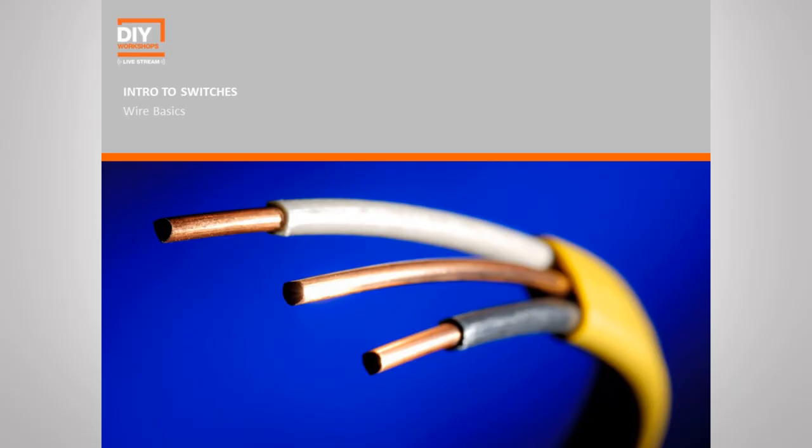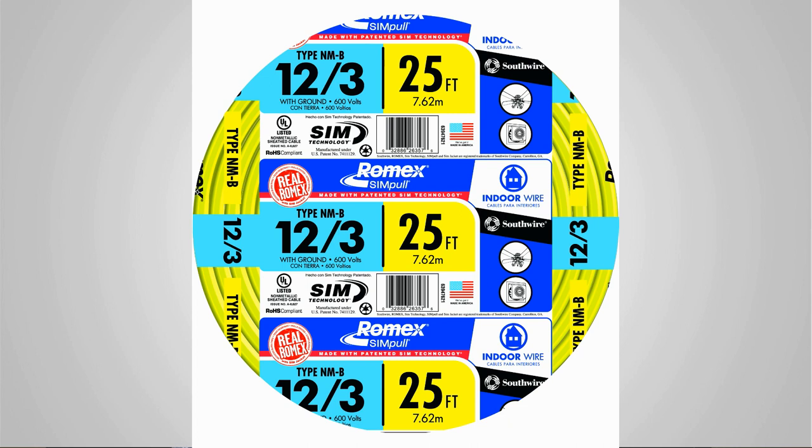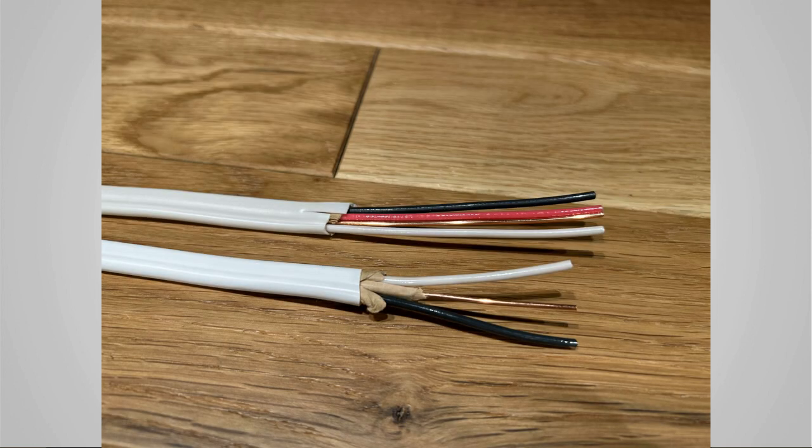Before we go any further with the circuits, we should look a little bit closer at the wires themselves. Most of the wiring in your home is what's called non-metallic cable, which means there are multiple wires encased together in a single outer sheathing. When you're looking at it, you'll see that there are numbers on the outside of the package, usually something like 14-3 or 12-3. And these numbers mean something. The first number refers to the gauge of the wire, or how thick it is. And the second number refers to how many wires are inside the cable.